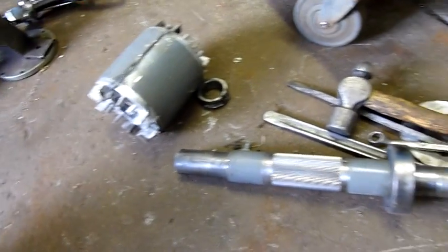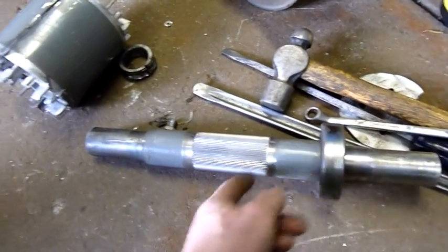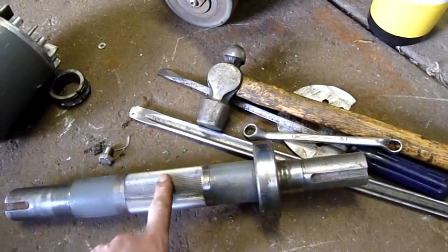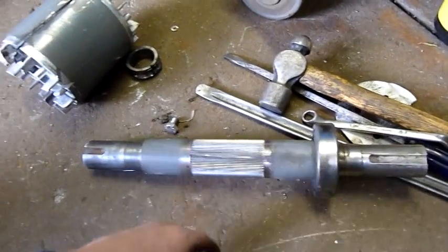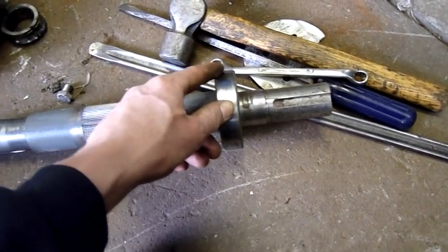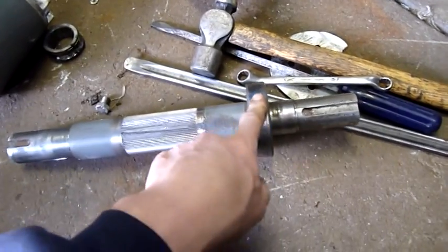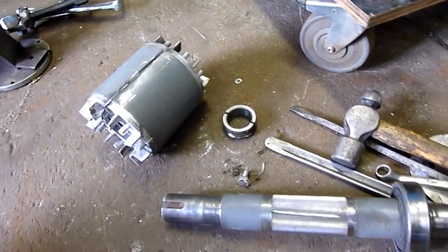I'm trying to keep the whole profile as compact as possible. I did think about using that other end bell — turning this shoulder a bit longer or turning it back and using that other end housing — but I'll try and keep it compact. That's why I didn't go with the generator idea; it would make it too big. I shouldn't have to remove that bearing at this point. The main reason I didn't remove it earlier is because it's well pressed on, and if I do have to remove it, it'll likely result in its destruction, so I'd have to buy a new bearing. The remaining piece I'll just cut through until it's split — job done.